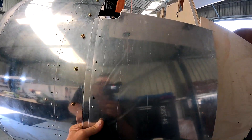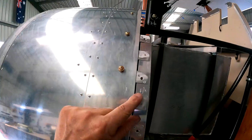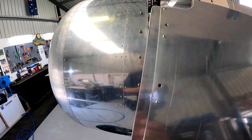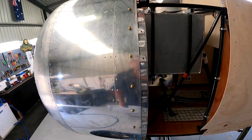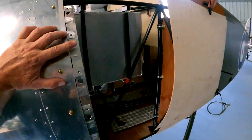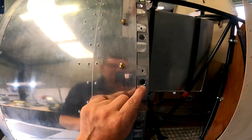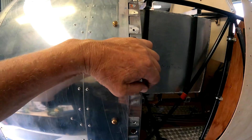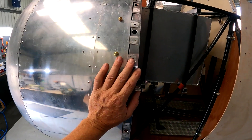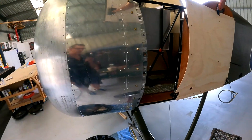I was having trouble getting this back on. The reason is I've got rivets in my tongue - the tails are hitting here. So I think I need some slots for the tails. Next hurdle to overcome. I've added some lightning holes, if you like, for those rivet tails. Ideally I'd make slots, but then that defeats the purpose of my bracket that I've got going on here. So we'll offer that up. Bear in mind I need to tuck it in and it needs to be able to slide, so I'm hoping I can get just over this lip. Then I'll look from inside to make sure that each rivet has got clearance, and hopefully that solves that issue.